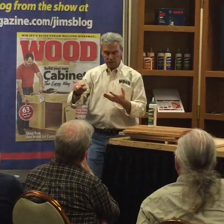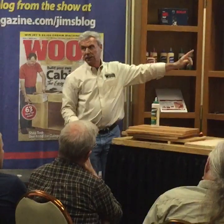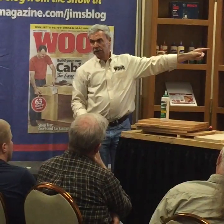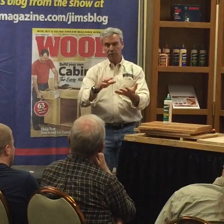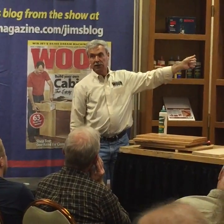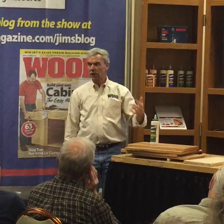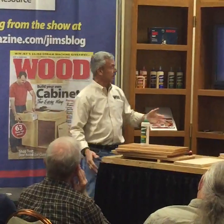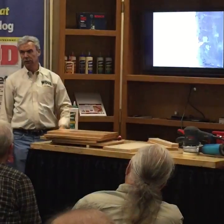So in the fall here, when it's cool and it's damp, it's going to take a long time for that glue to go popcorn on you. But during the summertime, especially in mid-summer, when, like us, the temperature is in the 90s and humidity is pretty low, it could be 20 minutes, 30 minutes, and it's already getting a hard skin on it. The problem there is you have to watch it. Now again, there's nothing wrong with either technique. This one I think you have to pay more attention to. In mine, you just wash it and you're done with it.